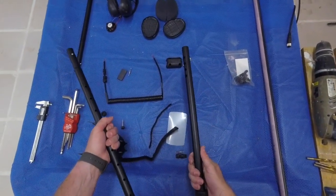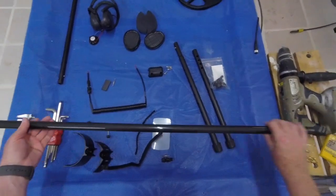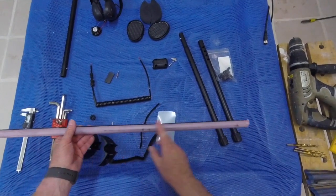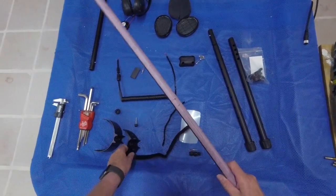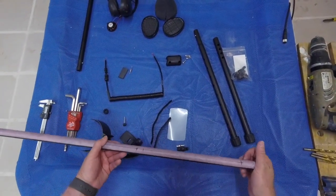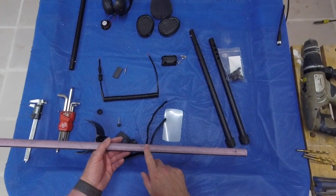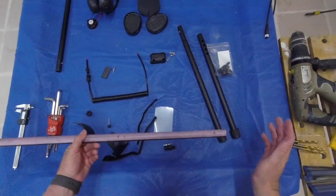The two top shafts I'm going to do away with, and I'm going to use a 1 meter carbon fibre shaft. It's about half the weight. I've already put a bit of masking tape on here, and I figured out where the top hole is. It's a 9mm hole that needs to go in the top, and checking with the handle, again it's 9mm. That hole was only the one surface, this hole is all the way through, both sides. So that's the first job.